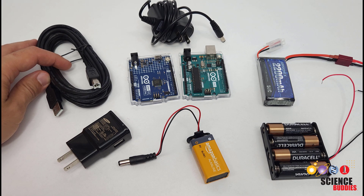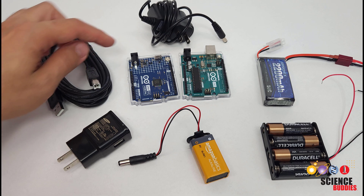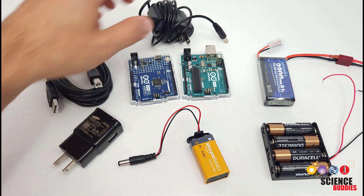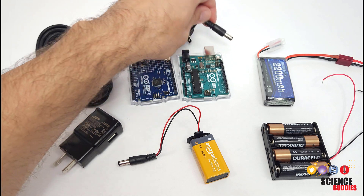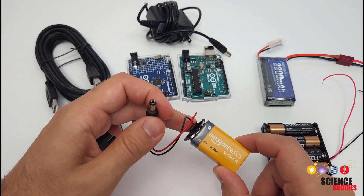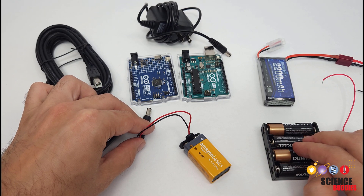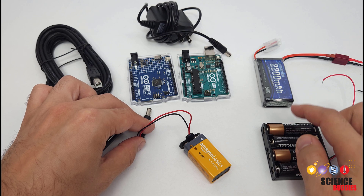That was a lot of information, so let's do a recap. When you are first starting out, you can power your Arduino with a USB cable plugged directly into your computer, but the type of USB cable you need depends on your Arduino model and the USB port on your computer. When you're ready for projects not plugged into your computer all the time, you can switch to either a USB charger or a wall adapter with a barrel plug, but you need to make sure the voltage is compatible with your Arduino model and the plug dimensions are correct. For mobile projects not plugged into a wall outlet, you can use a snap connector with a 9 volt battery and a barrel plug, but this won't provide enough current to power motors for a long period of time. To do that, you'll need an external battery pack like a 4xAA battery pack or a lithium-ion battery, and we have additional tutorials linked in the description showing how to connect those to power motors.